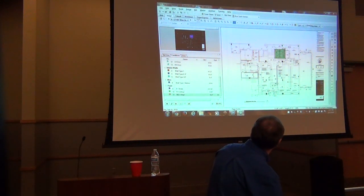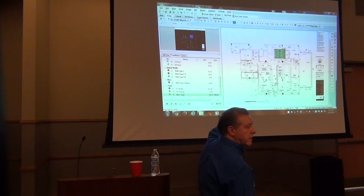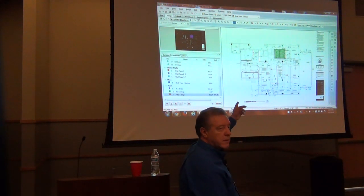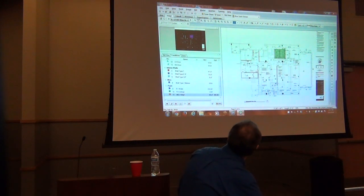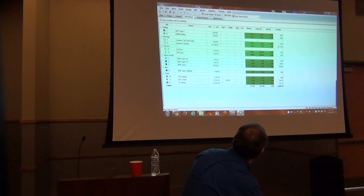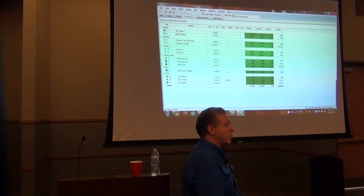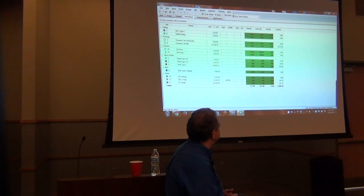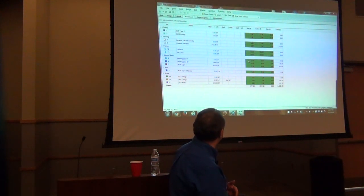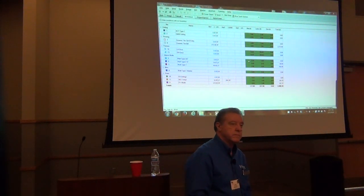I could keep going, but the reason I wanted you to see this is my conditions are already here. They're the same ones from the original. It's a template. I didn't have to create those again. And even better, so did my unit prices. I'm at $3,400 so far. The spreadsheet is there priced out, waiting for me to put quantities in. If I kept going on the takeoff, I'd hopefully get close to another $26,000.